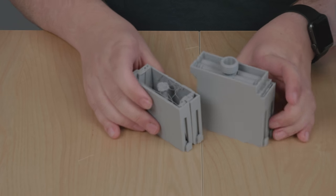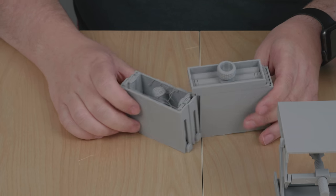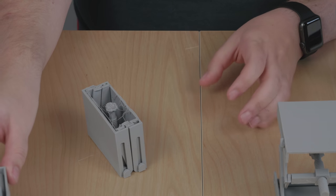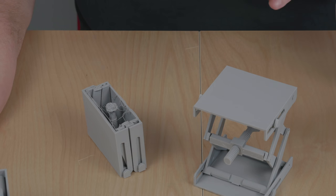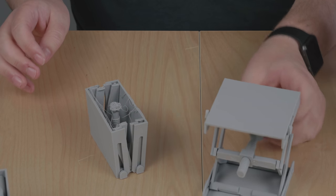The third model is this platform jack. With this model I actually had three failures before it printed correctly, and this probably was caused by the printing speed. After I changed to a slower speed, it came out very well. As you can see here, there are three layer shifts, and that's actually the problem. Once it printed correctly, it had a bit of a problem with the bridging. But as you can see here, it worked out okay, and the model works perfectly fine, like you can see.